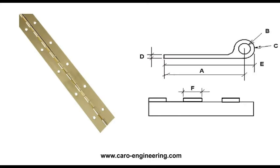Here the bearing stress is lowest because the brackets are very wide. In some cases the hinge extends over the full span of the control surface. This allows the hinge pin to have a very small diameter and the bracket material to be very thin because the loads are well spread out. For airplanes, aluminum is typically used as the bracket material and the pins are steel.